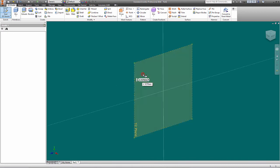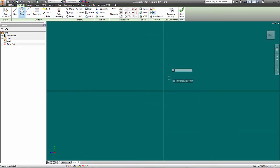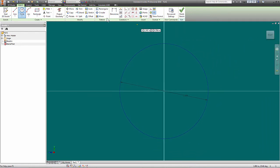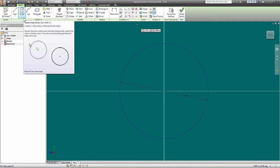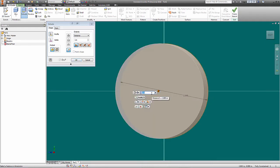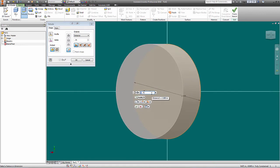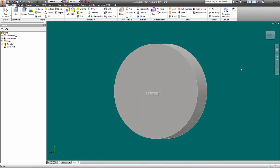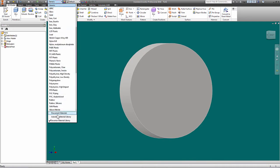Since we're working with a circular piece, I'm going to grab a circle. Our stock is approximately two-and-a-half inches, so that would be 2.5 — and we're going to finish that sketch right now. I want to make a hub — let's say three-quarters of an inch just to see how that comes out. Going to 3D model and extrude: one inch is too big, let's go 0.75. That looks groovy. So there's a chunk of aluminum.